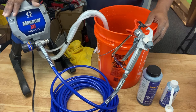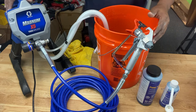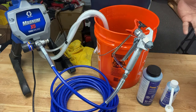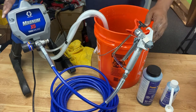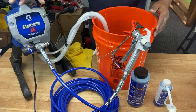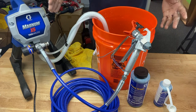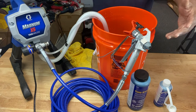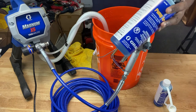In this case, it's a paint sprayer right here — we got the Magnum X5 that we're going to use it on. So what is pump armor? Pump armor is essentially antifreeze for your pump, for your machine. And it protects against corrosion. If you leave your machine sitting too long without using it, the water inside the pump from a previous use will corrode the pump.